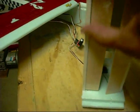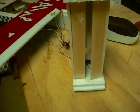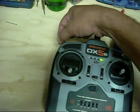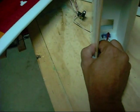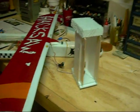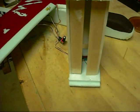Right now the doors are just attached with tape; eventually they'll be attached with a nylon hinge to ensure they don't move anywhere. This mock-up is just to ensure that I get the servo operation — the mechanism to open and close the doors — and get everything lined up as best I can. With the gear switch on my radio I'll flip that and hopefully get operation. The doors open completely, and once attached with nylon hinges they will close completely and it will be a flush surface.